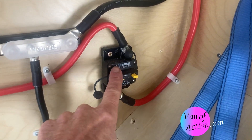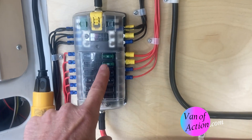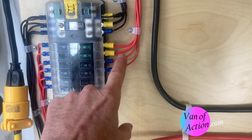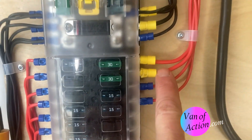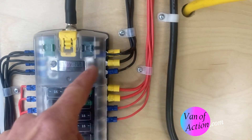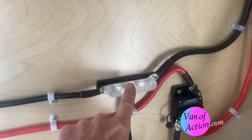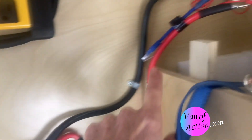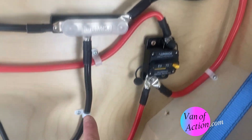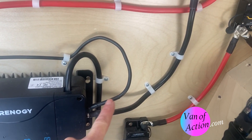It comes back down that wire, then it goes through this breaker for protection, goes over, and feeds the 12-volt fuse block. The 12-volt fuse block has the wires from all the different circuits you have in the van — the light wires, the USB chargers. The 30-amp one here is the cooler one because it's heavier. Red wires connect so the power goes out. Black wires connect so the ground comes in — black wires are the ground return wires. They come back and run through this bus bar. A bus bar is just a way to connect a whole lot of wires together. This is the feed that comes off the back end of the batteries, connects to the bus bar, takes both of these returns, and runs them back down into the charge controller. This skinny little wire is the black wire that comes off the solar array above.